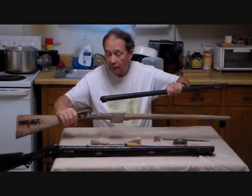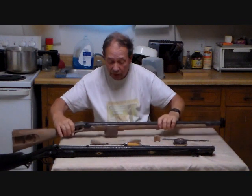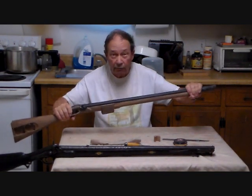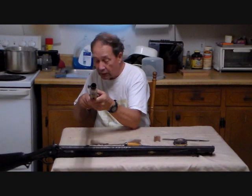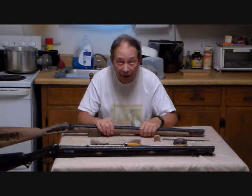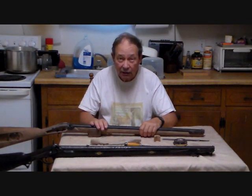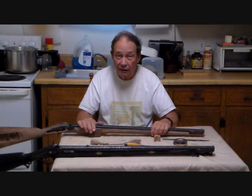We have the barrel now so it can go back into the breech and clamp down very easily and very solidly — that's exactly what you want. You don't want to have to push it over to one side or really crunch it at one end to seat it; you want it to fall into place. And we have the muzzle so that the bottom of the barrel actually fits. So we're coming right along with this. As I said when I started, this is probably the most challenging part — getting this barrel down in the stock. We still have to drill for the barrel wedges, but the main part of this is, thankfully, done.